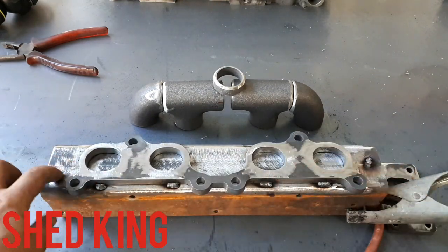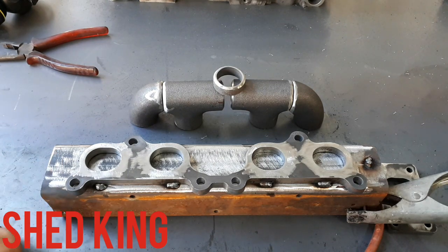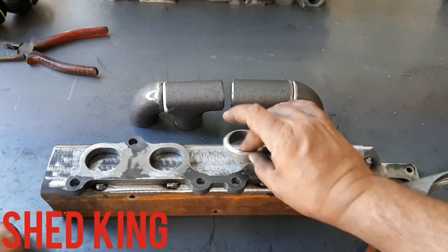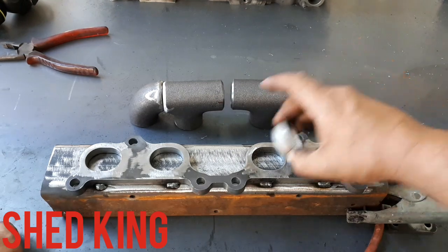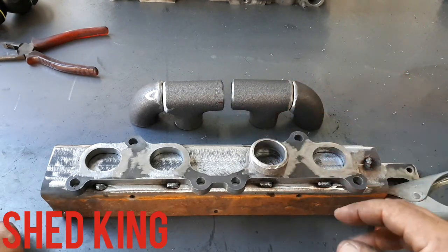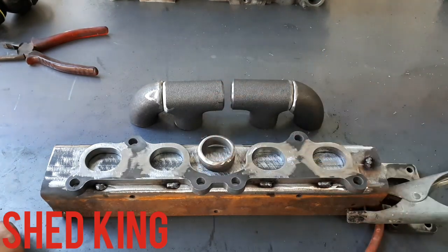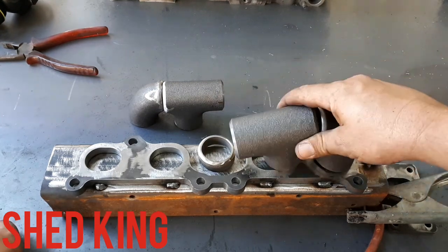Make sure you're using something nice and solid. This is like 6mm RHS, 70x70. Now, you have to cut these little bits off. That's around 20mm off that end. And it will be absolutely perfect. You put that 20mm piece in the middle, and it's your actual spacer for the guts. Works out mint. So it's pretty obvious.